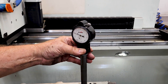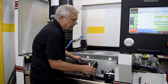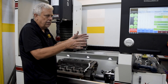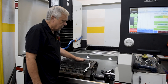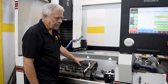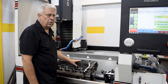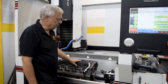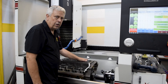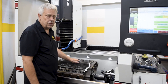Which is not good. What that's going to cause is excessive piston rock at the bottom of the bore. Obviously you can understand that the ring is now going in and out every time it goes up and down. So at that point we stopped, the customer's here, and we kind of explained that. It just goes to show you some of the shops out there — you might want to question their quality control. Here at Prestige we really care greatly about all those things, and every block gets to that specification.